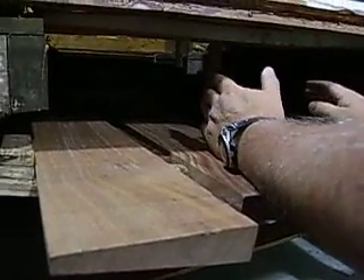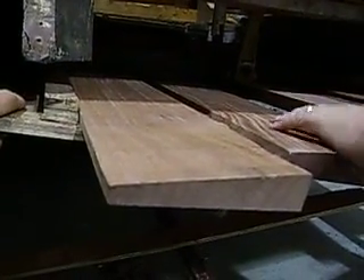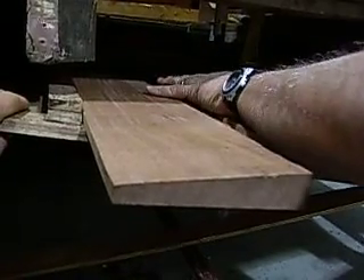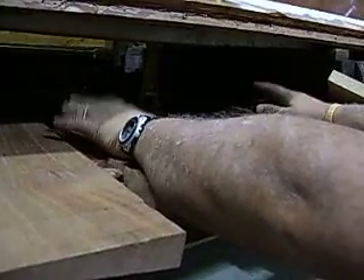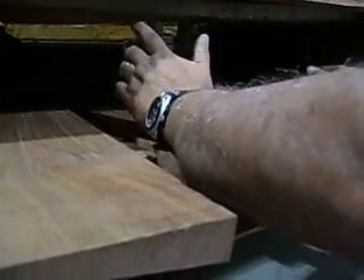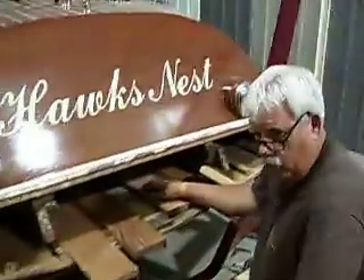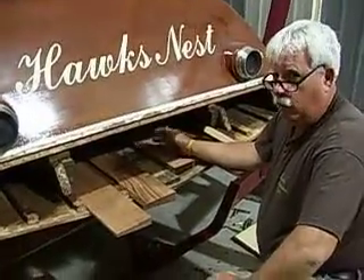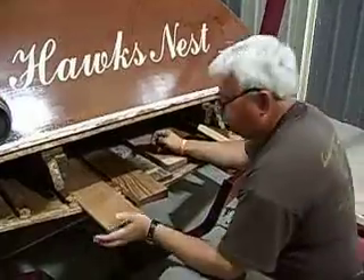I don't know if that made perfect sense — maybe I'll send you a drawing of what we're going to be doing. But we've got all our pieces cut, and this will all be one area that's bonded together, and all of the vibration in the strut will be passed into this big massive piece of wood. This is basically the way Chris-Craft did it — this might be a little heavier than Chris-Craft did it, but it's pretty close. It's a lot heavier engine than what Chris-Craft put in them typically. We're borrowing off of their design principles, and their boats have been out there — we're talking to a guy whose boat's been out there since 1941, looking at putting a new bottom on it. So 70-some years — the proof's in the pudding on those guys.